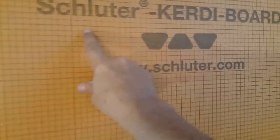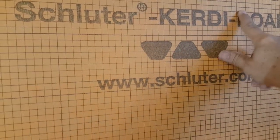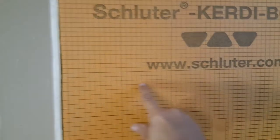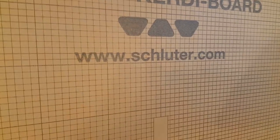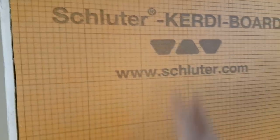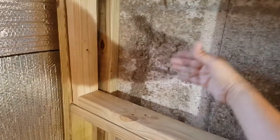We've already started installing some of the Kerdi boards on this end here. The important thing to remember about these Kerdi boards is the graph lines they give you on the board. It is so important that when you mount this board, you use these lines to help level - put your spirit level right on the line, make sure it's completely level, then start to screw in the board. That way once it's screwed in, I know these lines are perfectly horizontal and these lines here are absolutely perfectly vertical. This will be a great guide to help you as you're tiling - great sight lines.